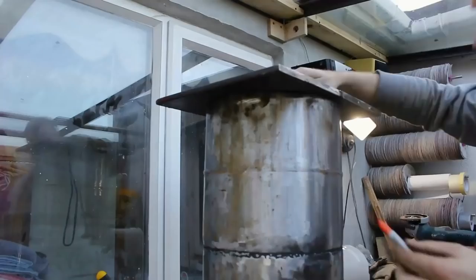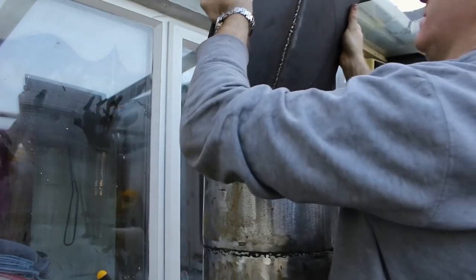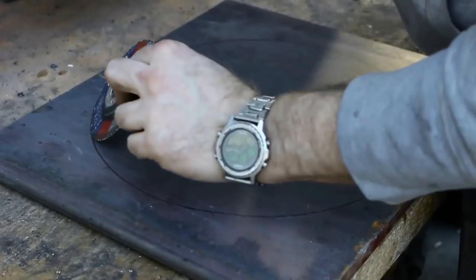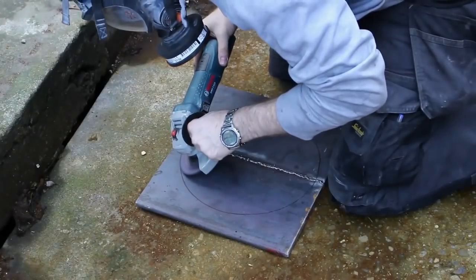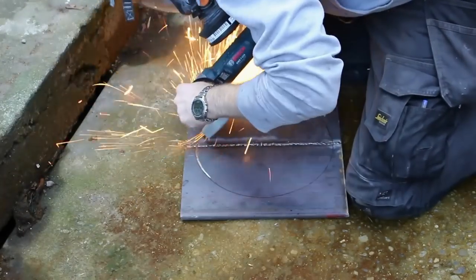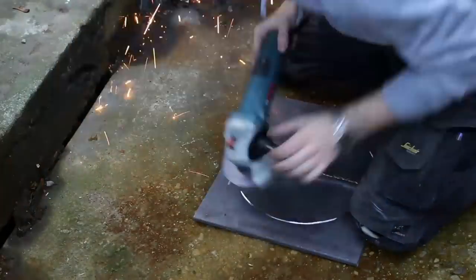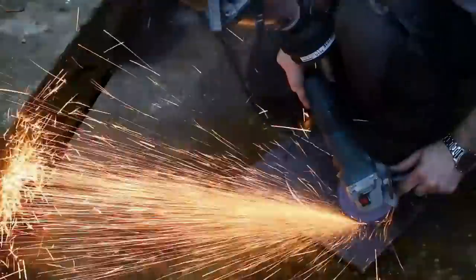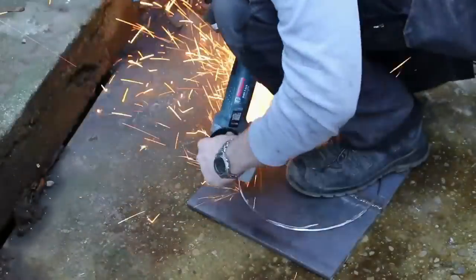Next I put the top on and then using a marker I marked out the exact circumference of the cylinders. I used the grinder disc at a slight angle which enabled me to get a much finer circle. I did this so it would fit together with the top of the rocket stove — I don't like the idea of welding it up so I can't ever clean it or see inside it. By doing this I can drop it on the top and use a small amount of sealer such as fire cement or high temperature silicone, and it's perfectly sealed.